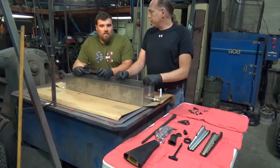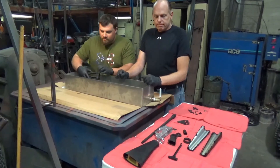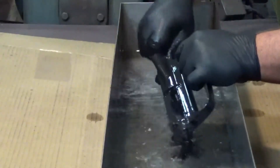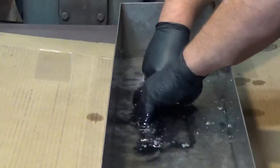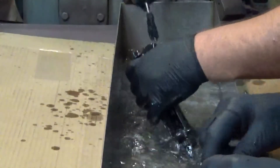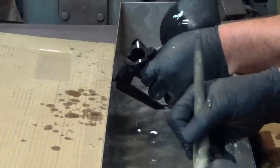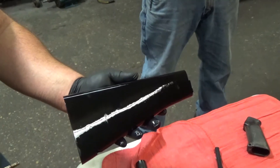Even after that we're not going to trust it - that's why we're going to follow up with acetone. Better to be safe than sorry. Get some brushes of different sizes and you can get right down in there and get all that gunk out. Get some little ones down in the tight spots. Make sure to completely blow dry your parts before you go in the blast tank.